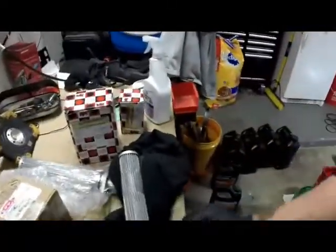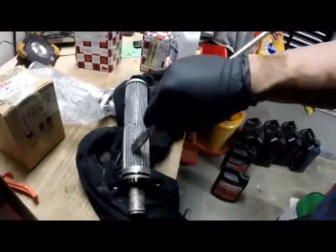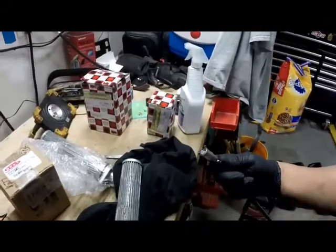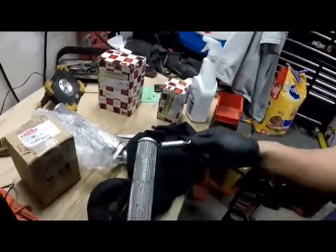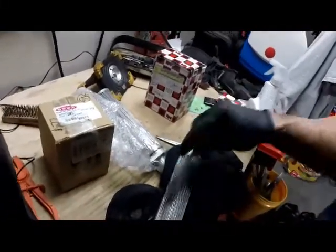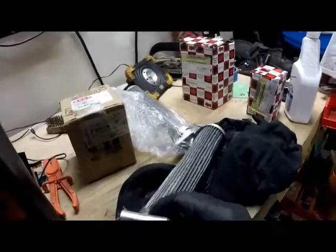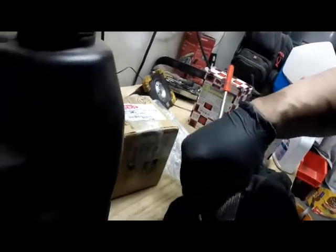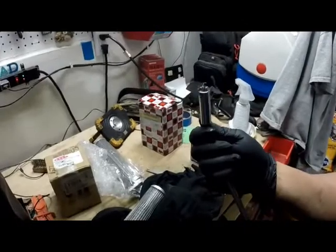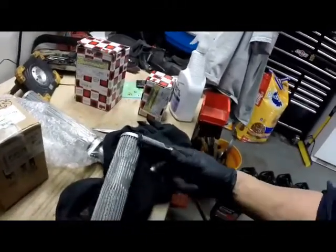We got our suction filter out of the tractor and we do have a significant amount of metal on it. Let me get my magnet and start picking some of this stuff up. That's what I'm getting from the filter. I would recommend — even though the owner's manual doesn't say to do this, but the service manual does — definitely on your 50-hour, take this out, clean it, inspect it. This one is going to get replaced since I just happen to have a new one. We've got a little bit of gold shavings there — looks like copper, maybe a copper gasket of some sort.